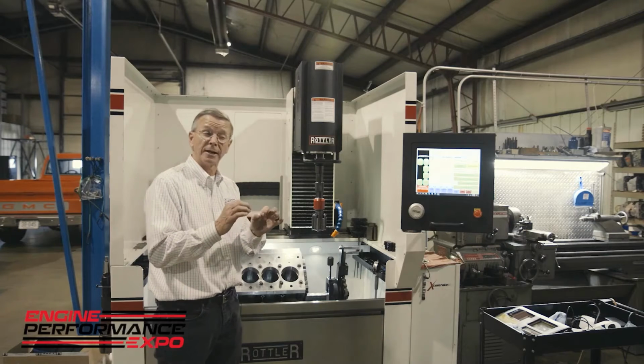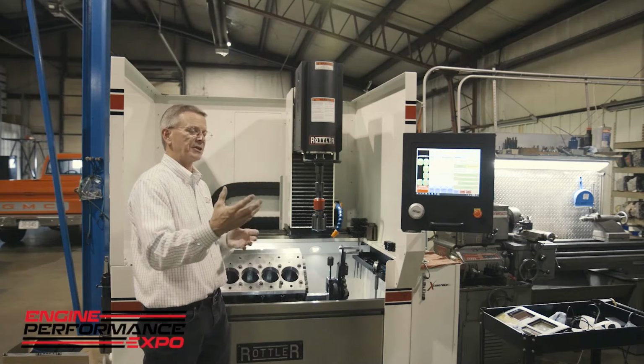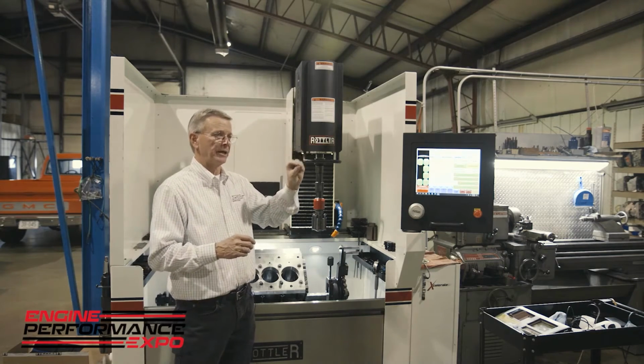Let's say we wanted a little bit higher RPK. We wanted 15 to 20 or maybe 16 to 22. Then I might go down to a 500 grit CBN abrasive and do the very same thing. Same pressure, same amount of strokes. You may have to go a few less strokes because you have a little bit rougher abrasive, but then your RPK number will come up. No matter, the biggest misconception with fellas that are trying to do the plateau finishes is they think when they put the finished stone in and they go from 10 strokes to 20 strokes that it's going to lower their RPK number. It will not. Once you hit that base, your RPK number will not come down. It will maintain that level.